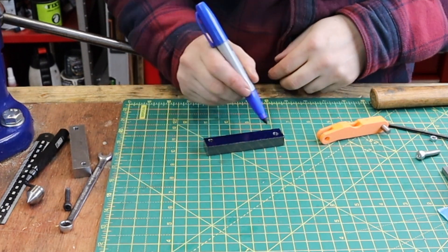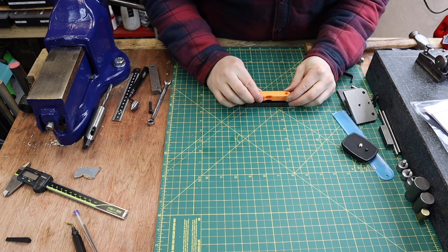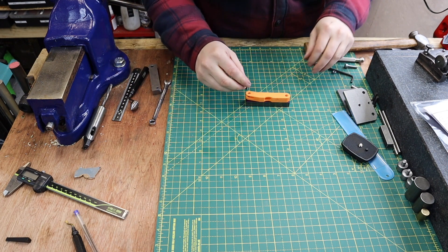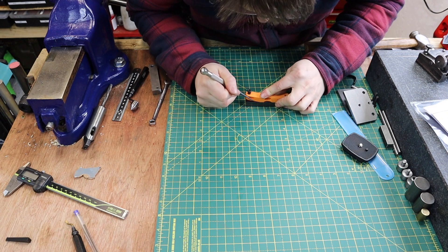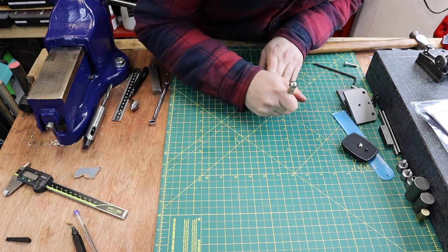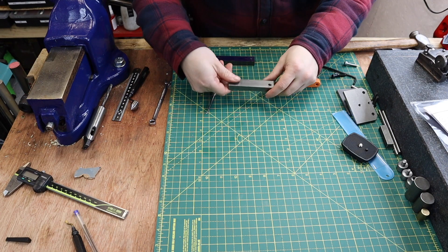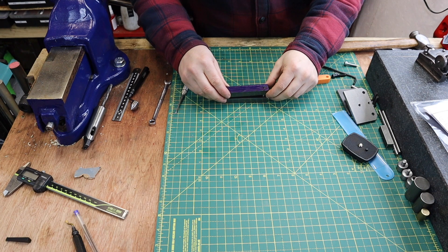I've thought about a lot of fancy ways of doing these next operations and the best method I came up with is using a 3D printed model of the drawing. I'm going to scribe around it and that will give me the marks that I need to then machine to. I was using some quarter inch dowel pins and a 5mm bolt to get the model in position, then scribing around the block until I had some good lines to machine to. With that done I can bolt the two pieces of metal together - that way all the machining can be done in one procedure rather than having to repeat it for both.